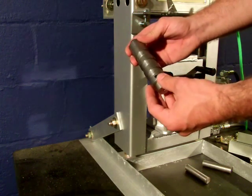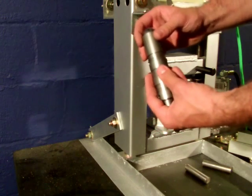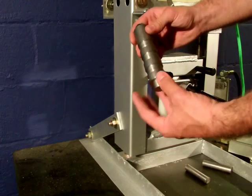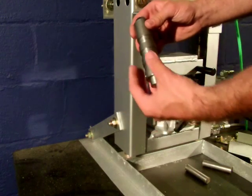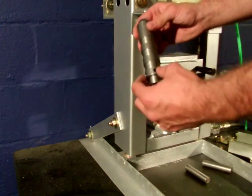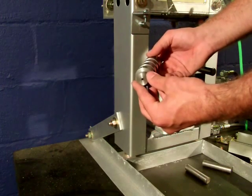This plasticizer does not have to be switched out. The reason you would want to switch it out is if you are changing the plastic from one base to another and would like to mechanically remove it. This old metal part is going to contain all your old plastic around it, and then the plasticizer with the new plastic will go in its place to allow a quick material change out.